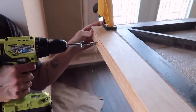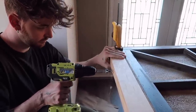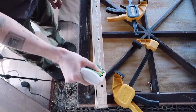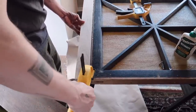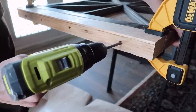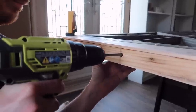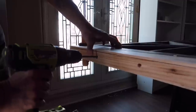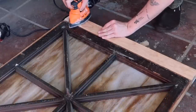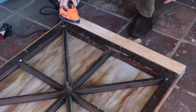I actually used my pocket hole jig, and I find this to come in so handy. I didn't have one for the longest time, but I highly suggest investing in one. I will link it in the description box because you don't only have to use it with the actual diagonal pocket hole method - you can use it as a drill bit and create pocket holes in anything like I did on the bottom of this door. I just drilled the holes and screwed in some two-inch screws all the way across the bottom for a nice secure bond. Then I brought the door outside for a good sanding to make the surface smooth and flush with the original door.